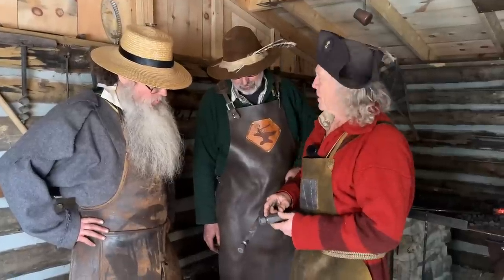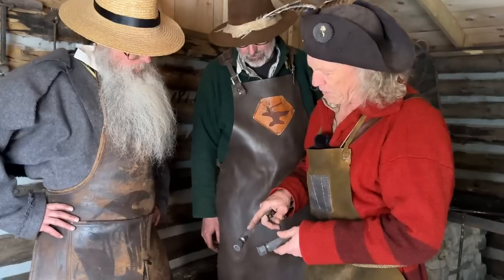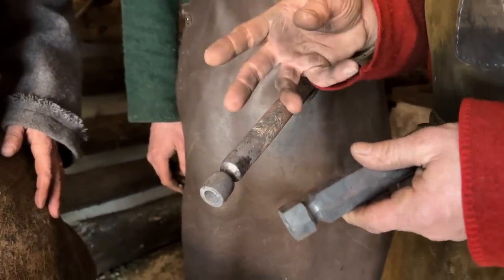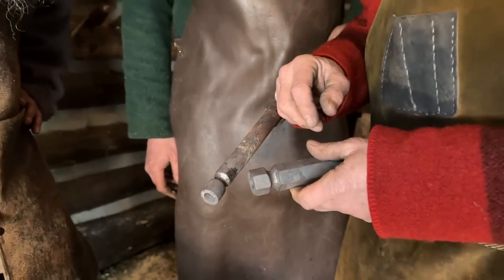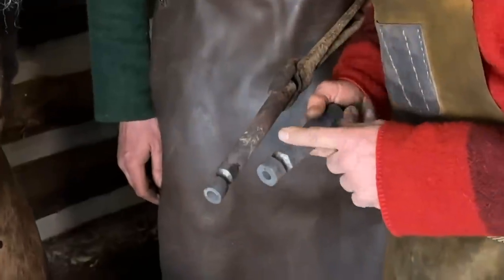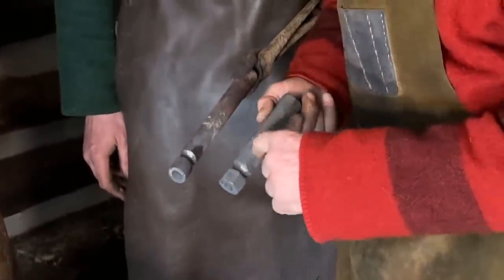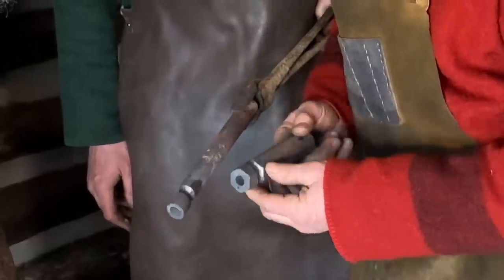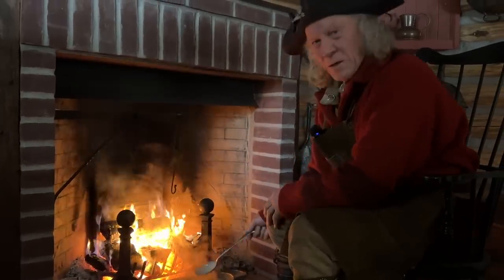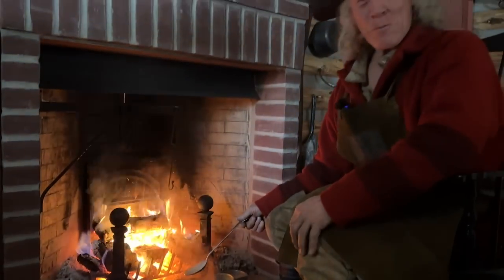So we've got a good start here on both the round pipe. This one's going to be a little delicate — there's just not as much material in this. So I'm going to get into a wee bit of history of the axe in a little bit, because I like to watch guys work. I can talk, you guys can work. We've got a good start here for the junction of the bowl to where we're going to flatten it for the eye and then split it to form the axe head. So Kathy's billed us this fine potato leek soup for three hungry blacksmiths — if I can get them away from the anvil for a few minutes. We're going to load up here and get back at it shortly.